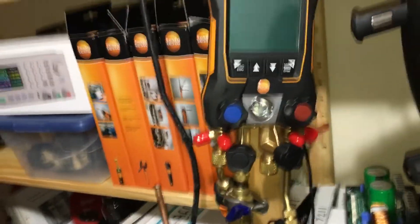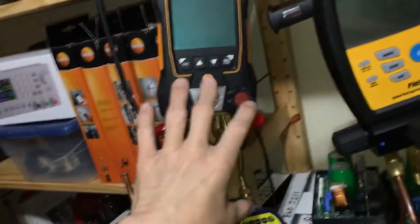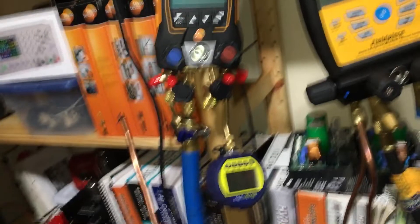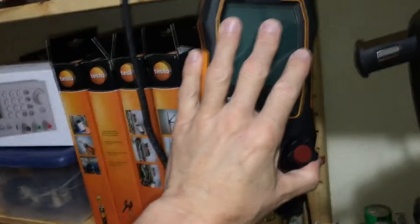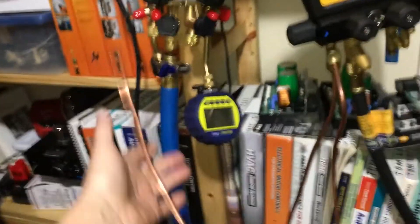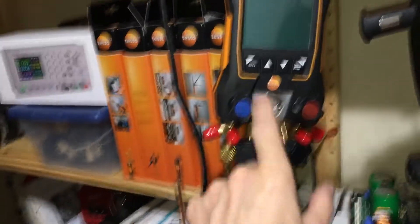But that's only brand new - what about after you've turned these knobs a hundred times, done 50 or 100 jobs, scraping that seal back and forth? You passed right now, but what about a month from now? Without actually testing your gauges, you'd never know - is it your gauges, your hoses, your connections, your seals, the Schrader on your hoses? This is why refrigerant manifolds are not recommended and were never designed to perform low vacuum decay tests, but if you're going to do it, use metal lines not rubber hoses.